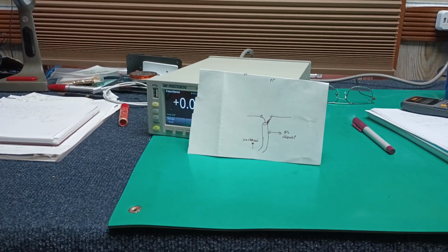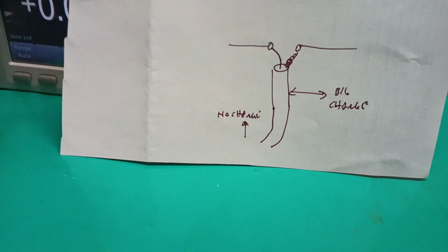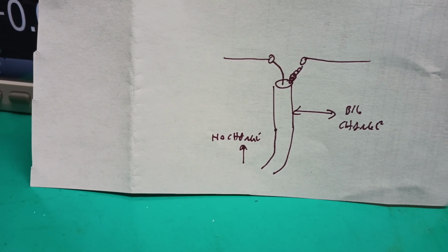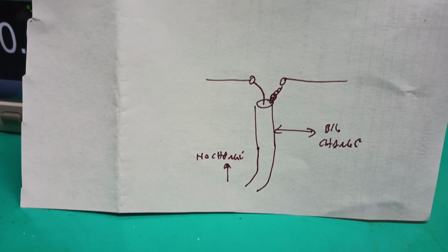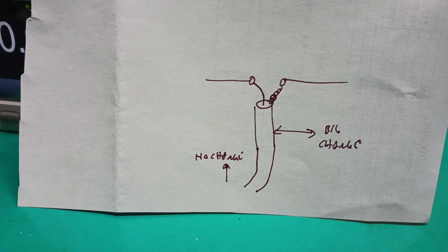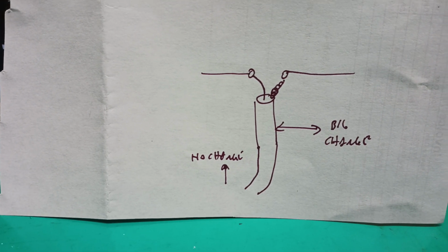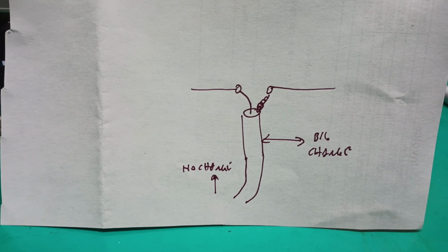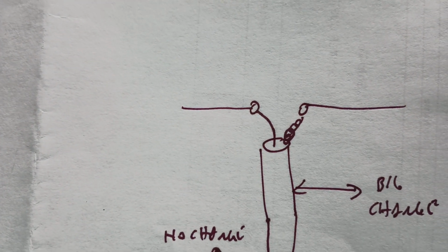But why is it in a dipole? I noticed, according to this fantastic picture, that when I picked up the end of the 20-meter dipole line at the ground and lifted it, went back 50 feet and lifted it, nothing happened. But when I tilted the line side to side along the wire, significant change in match. And this revolves around the question of exactly what happens at that feed point.